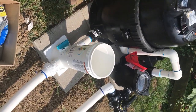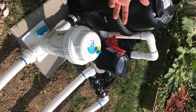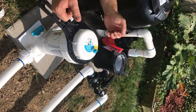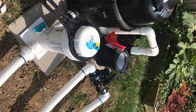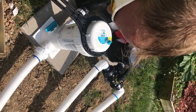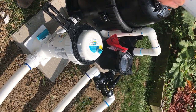We'll keep it just like that for now. There's also an air release valve here, but we don't usually use that one because there won't be much air in there. The wrench is just to loosen it, not to tighten it — make sure you don't crank it down or you'll ruin the O-ring and it'll be really hard to get off. All the O-rings are already lubricated; we use silicone. They'll give you a whole bottle, because everything in the system comes apart — all O-ring fittings — so it's real easy to get back together.